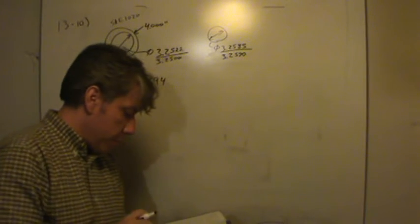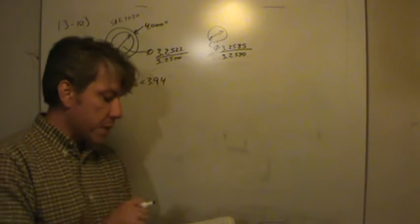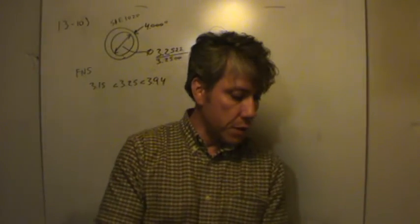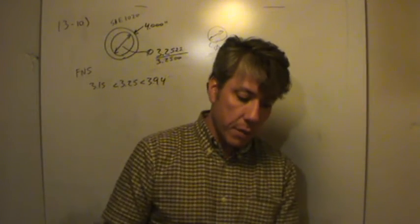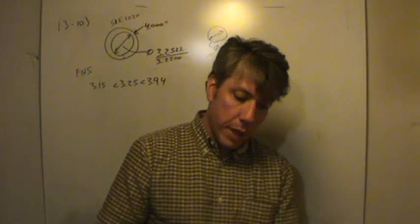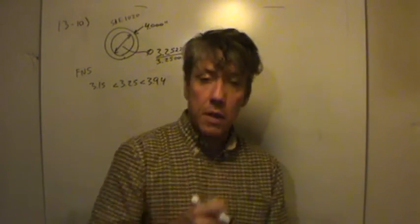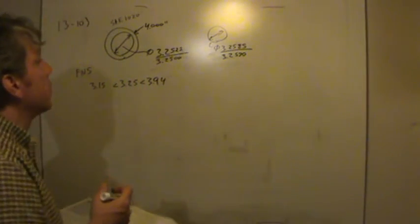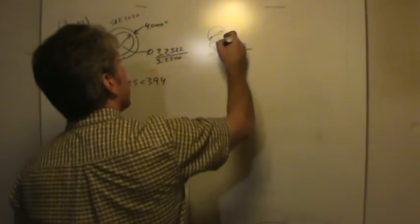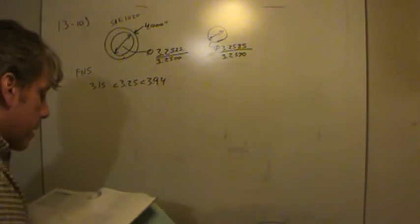So there are the specifications on the size of the hole and the shaft. Now we're supposed to specify the dimensions, we've done that, and compute the stresses in the sleeve after installation. Now there's a couple different ways of installing these things. You could just drive the two together, which is not going to be easy with this much interference. Or you could heat up the hole to make it expand and cool down the shaft in order to make it shrink. And then you can slip the two together. So this is quite a bit though. This is a pretty heavy fit. So even after heating one and cooling the other, unless you attain some pretty extreme temperatures, I think you'll still have a decent drive fit here.